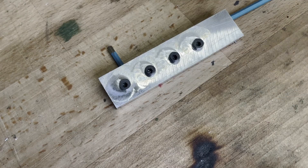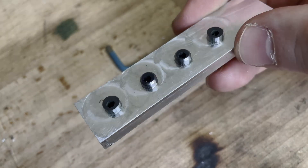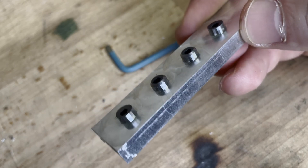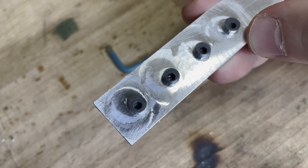I was a bit too cautious, but these are the first parts I'm machining in steel so I'm being a bit over-cautious when it comes to tool engagement. You can see the adaptive toolpath doesn't really round the corners fully, but I think for a first trial that will be fine.